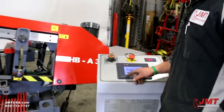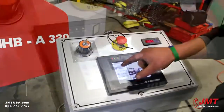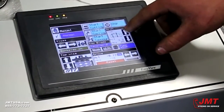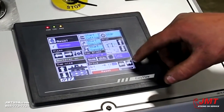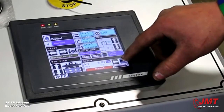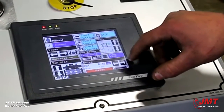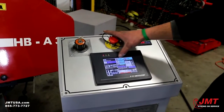To set up a program, your start button will go to manual mode first. You've got your top arch which raises and lowers your beam. You've got your vises open and close, and you've got your feeder which feeds out however long you want to cut your piece — say you want to cut it a half inch or so.